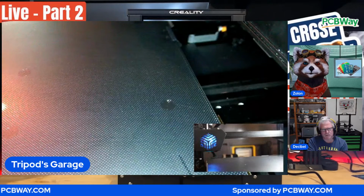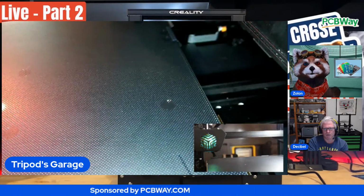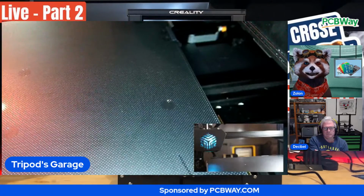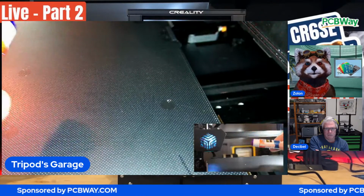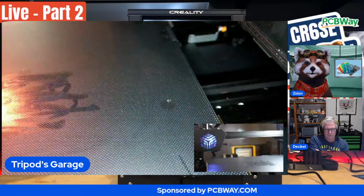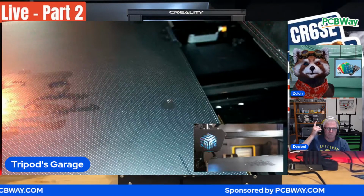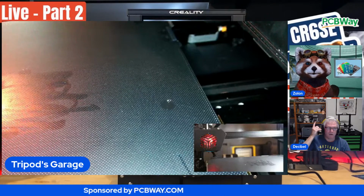White seems to be the bugbear for sticking, or lack of sticking. My white, yes, two different brands. Every other one is fine, but white TPU on a glass bed with no release agent is a nightmare. I use the Ninja Flex white on the glass bed for my TPU, and just the heated bed worked perfectly. I could not believe how well it worked.